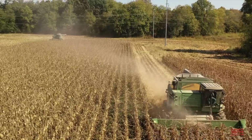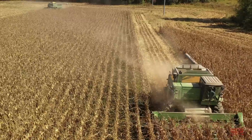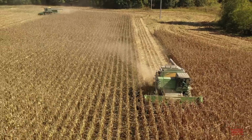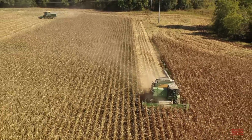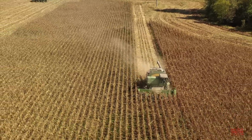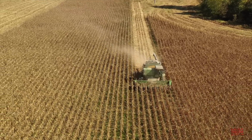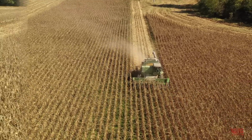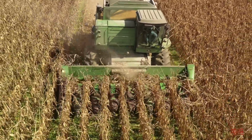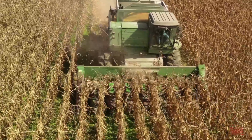Happy Tractor Power fans, this video comes to you from a cornfield located in western Kentucky, where a pair of 225 engine horsepower, 222 bushel storage capacity, John Deere 8820 Titan II combines are harvesting the crop. Equipped with 8-row, 30-inch wide spaced John Deere 843 corn heads, the 8820 Titan II was the largest combine available from the company during the later portion of the 1980s.